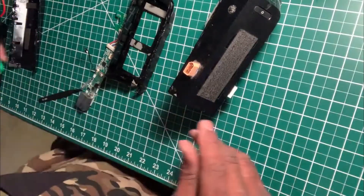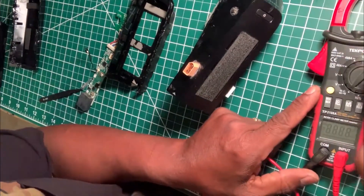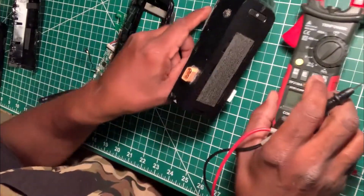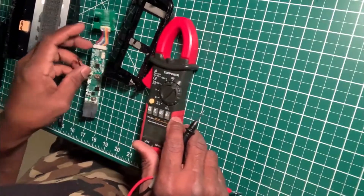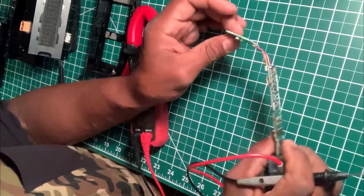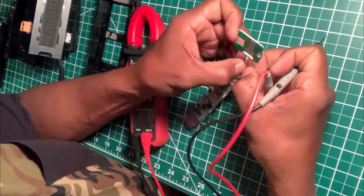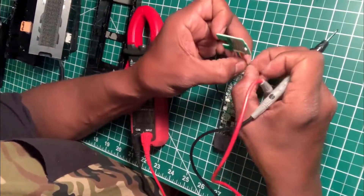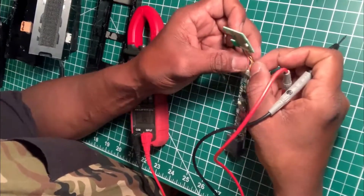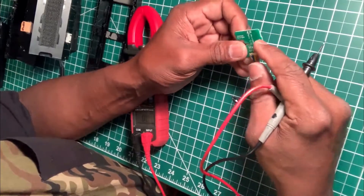Let's go ahead and disconnect it and we're going to find out which wire will trigger that. We're going to use a multimeter set on continuity. If you don't have a multimeter, I'm going to show you what wires are the ones that go to that switch. We're going to use this BMS board and it's going to be your top two wires if it's sitting this way in the board. It's going to be the brown wire and the red wire. You can separate these two wires - we're not going to cut them off, we're just going to scar it and remove the insulation off the wire so we can put in a wire to hook up our switch. It's only a momentary switch, not a permanent switch - it's momentary, so as soon as you push it, it activates the board and turns on the battery.